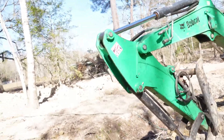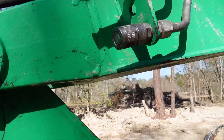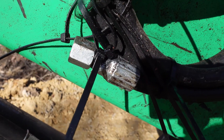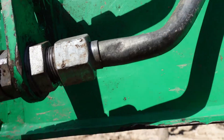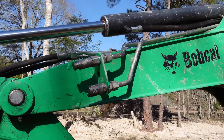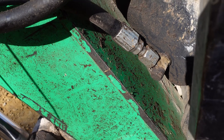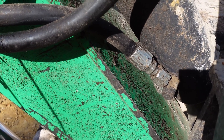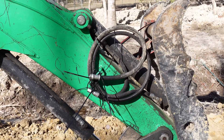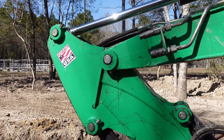As I already mentioned, I hit the third function hoses so much that on this one it broke — that fitting is actually broken off and the hose is leaking. I've already smashed brand-new hoses, and this one here has a dent in it — just a matter of time before these two get pushed in completely. This hydraulic cylinder for the third function valve is bent right here where it comes in, and one more hit will probably break it off entirely, meaning you'd have to replace the whole cylinder. I wish they routed the hoses better or inside.